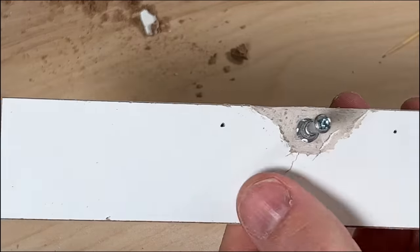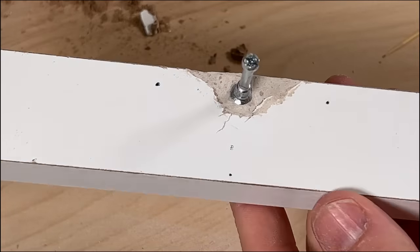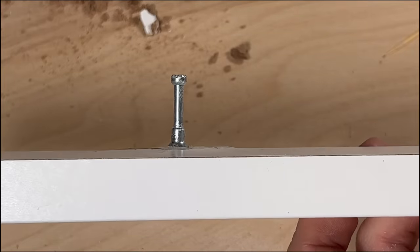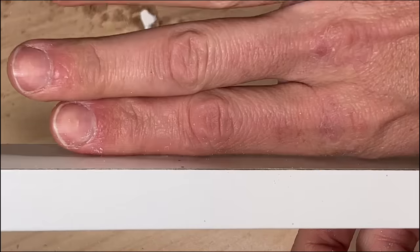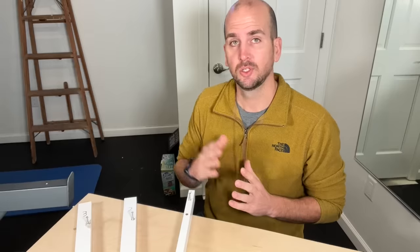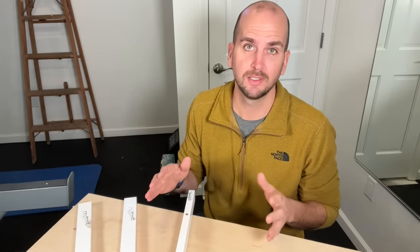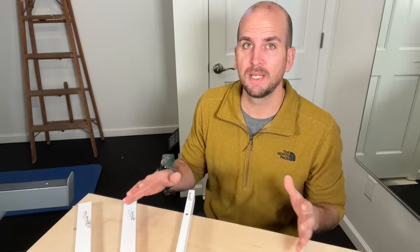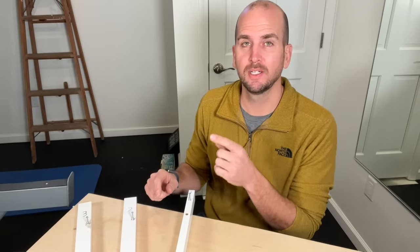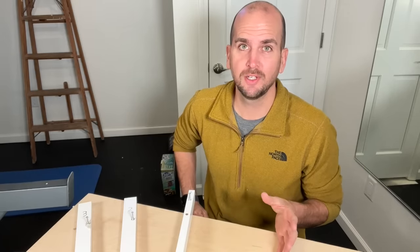Here's the finished product. Because it had the most damage, you'll need some touch-up paint if these are visible surfaces — it's not pretty, but it's effective. You have a smooth surface so your other piece of wood can sit on top, and a securely held, correctly positioned cam screw. Hopefully option one, two, or three will work for your situation and get you back on track assembling your furniture.